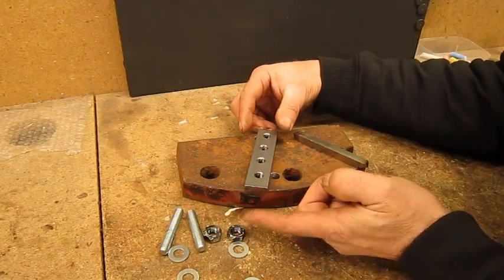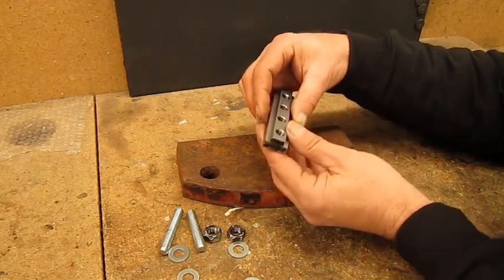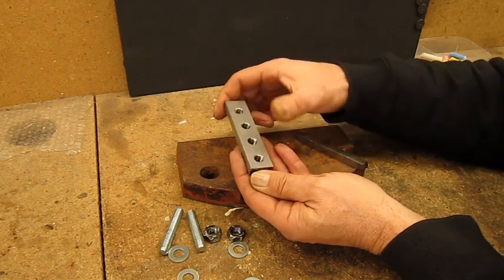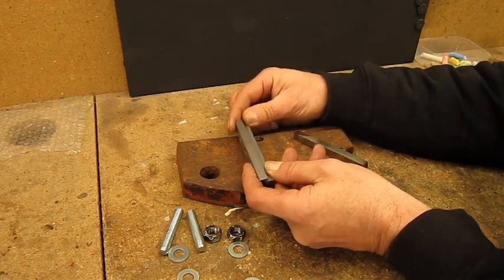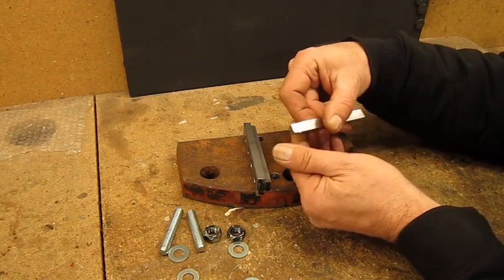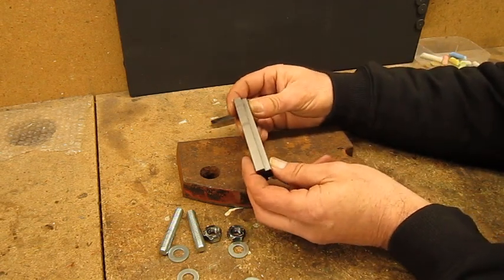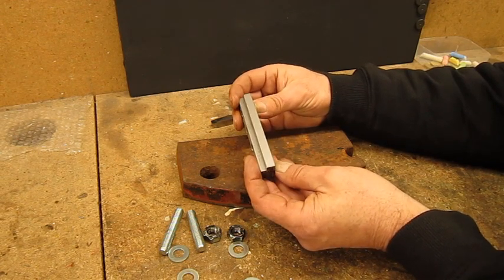And this is a finished product — well, almost finished. I just have to clean up. I deburred quickly not to cut myself. In the light you can see the surface finish. Of course it is not perfect, because we did not have any rounded nose on this cutting tool. But I think for the first time, don't worry about surface finish. Just cut and have fun.